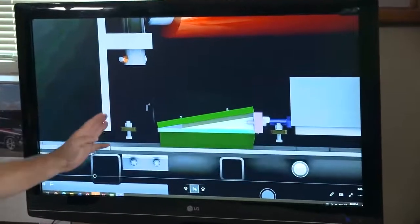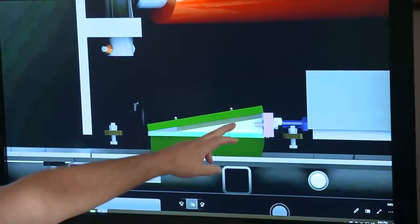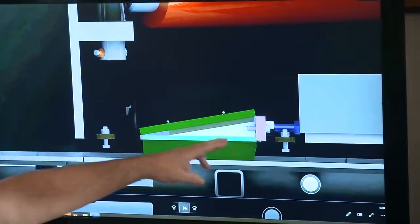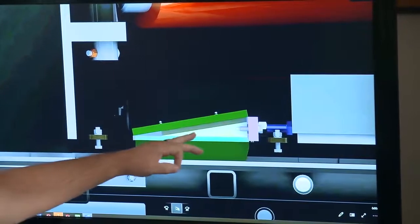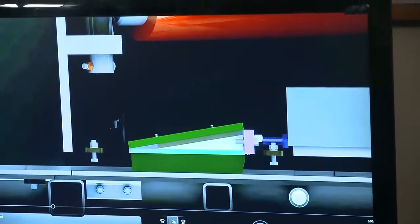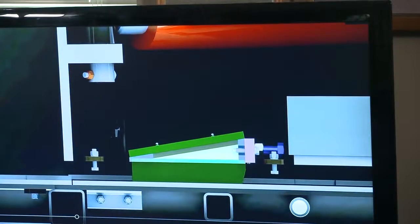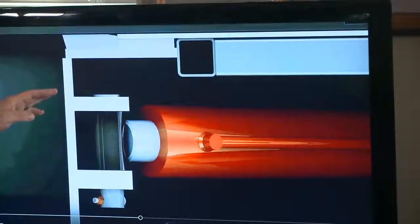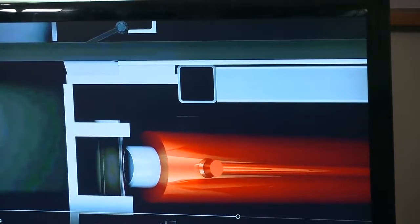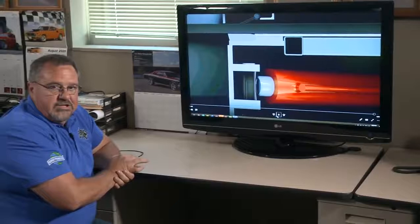Here's the ram face — these shoes are closer to the front of the machine. Here you have your wedge setup and your adjustment bolt. What you do is turn that adjustment bolt in, which pushes the wedge in, putting pressure on the pad, which in turn starts bringing the ram up. That way there's no need for shims — it's just some wrench work. The ram lifts, and then when you look at the top, you can see the hold-down bars. It can bring you up to the hold-down bars and get your shear tolerance back where you want it, so there are no gaps for wedging and jamming.